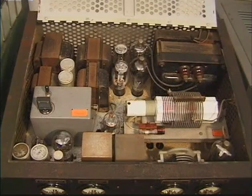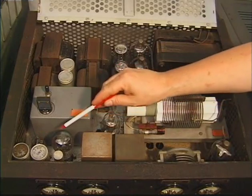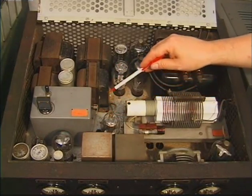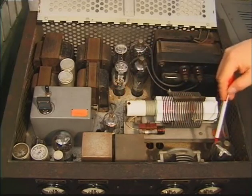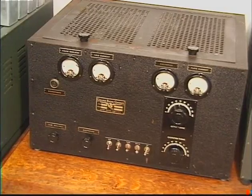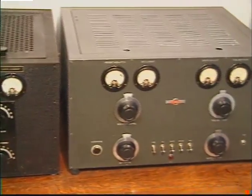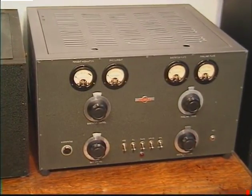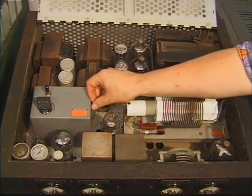In the original 1935 model, the tube lineup was a Collins C100A driving a 46 buffer, driving an RK23, which in turn either drove an 830 multiplier or the C201 final. A later, 1937 model replaced the C100A oscillator with a 6L6 and the final with a 211H, which is a 211 with a plate cap. Rapid frequency change was accomplished by swapping out 2 plug-in frequency change assemblies.